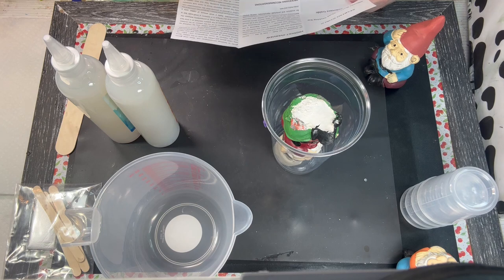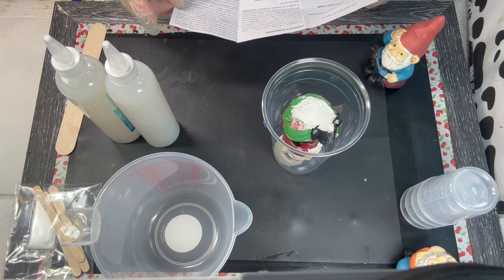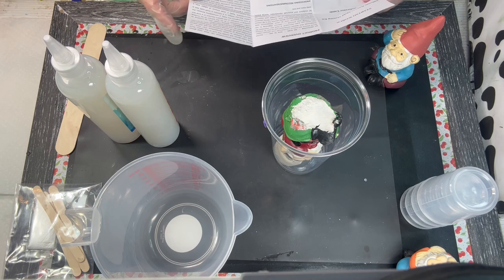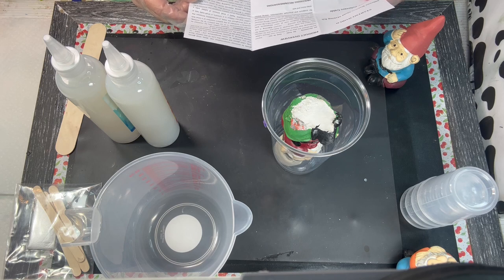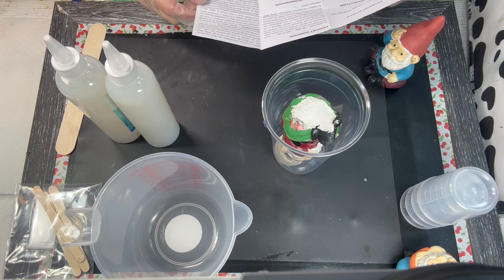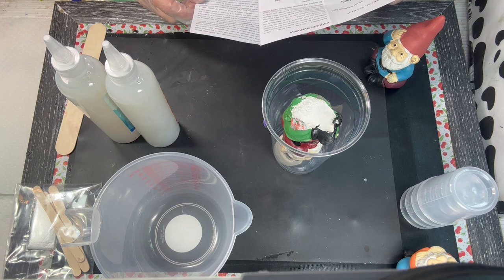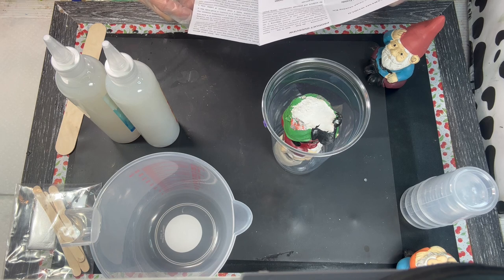Use vinyl, not latex gloves, because latex will inhibit the cure of the rubber. Store and use material at 73, I already said that. Silicone rubber may be inhibited by certain contaminants in or on the pattern to be molded. Let's hope that's not the case, resulting in tackiness at the pattern interface or a total lack of cure throughout the mold. If compatibility between the rubber and the surface is a concern, a small scale test is recommended. Apply a small amount of rubber onto a non-critical area of the pattern. Inhibition has occurred if the rubber is gummy or uncured after the recommended cure time has passed.